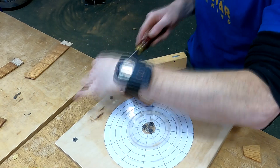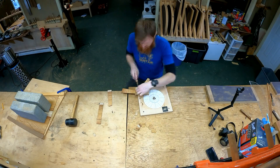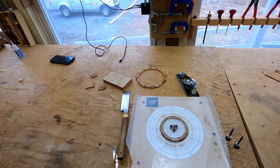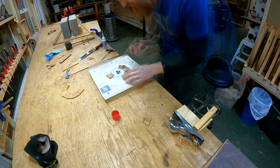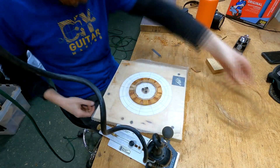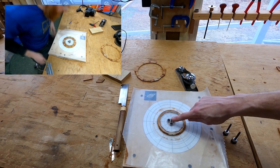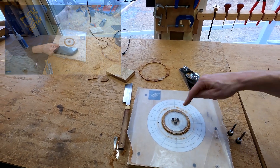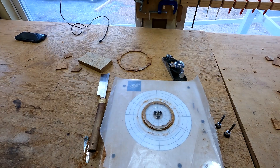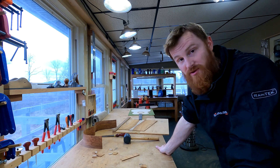Essentially, there is a wedge template that goes right here, and you cut the individual wedges from a strip of wood — in this case, rescued from the back plate. That gives you your individual tapered wedges, which you assemble under this circle clamp. Then you cut out your rosette using a Dremel with a circle cutting jig attached to the center pin. There's even an alternate pin location if you want to do offset rosettes. It's really an all-in-one rosette design system — fast, easy, repeatable, and fun. That's where I'm at for day one of Guitar 106.